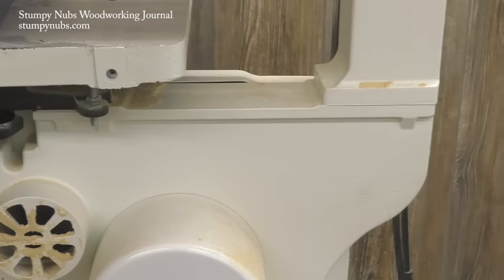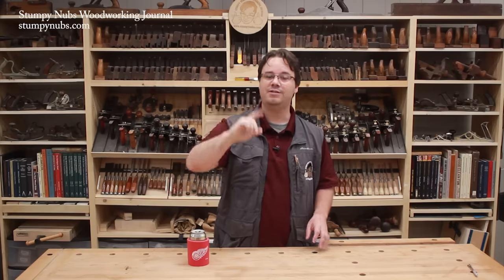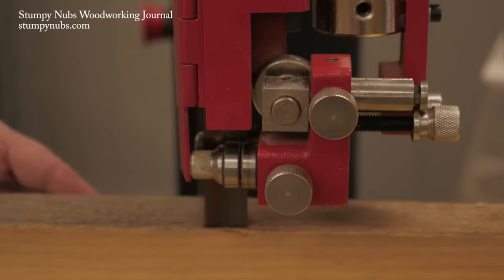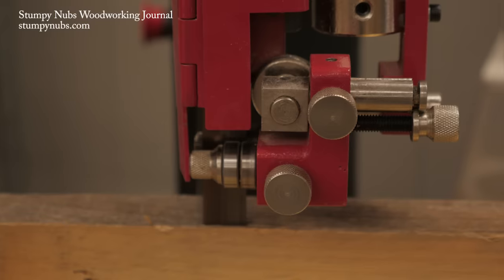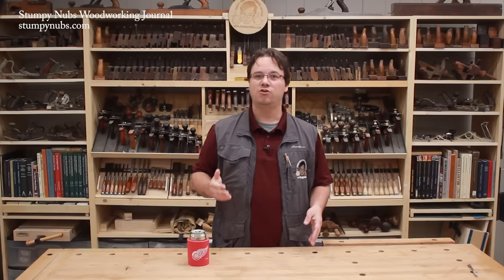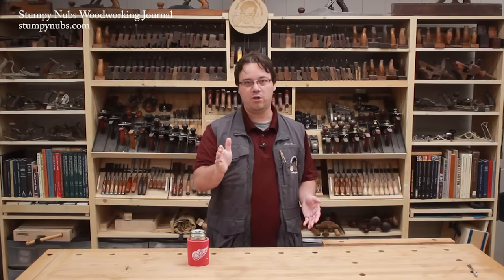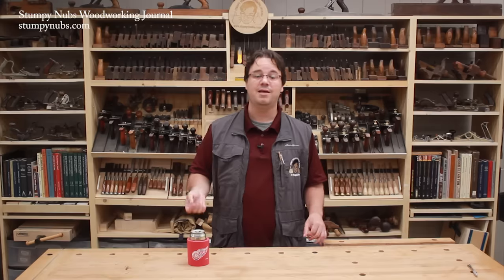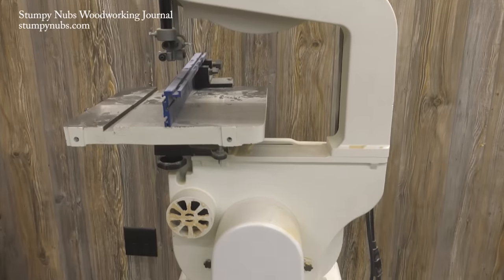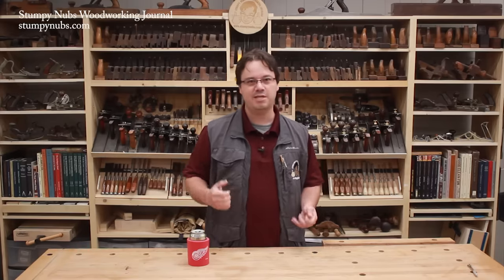Many cast iron frame bandsaws have a split frame, and you can purchase a riser block to raise the top half of the saw and increase your re-saw capacity. But understand that there are limitations if you modify your saw. A wide blade — such as you need for good re-sawing — requires a tremendous amount of tension, which can flex a cast iron frame, let alone one with two seams because you added a riser block. Because of this, you're likely limited to narrower blades, perhaps as narrow as 3/8 of an inch. Narrow blades make it more difficult to cut a straight kerf, leading to more planing and more wood waste — the difference between getting two slices out of your expensive board or three. Saws not meant for re-sawing typically have smaller motors as well, and increasing cutting capacity doesn't increase cutting power — it's unlikely to have the power to cut through 10 or 12 inches of hardwood.